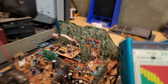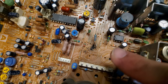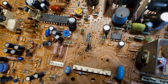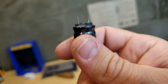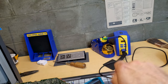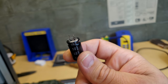Looking at the board where the capacitors were, there's a weird dark powdery substance on both positive ends — I'm assuming that's coming from the capacitor and electrolytic fluid. Looking closely at the capacitor itself, there's a fluid discharge on the positive rail. The other capacitor, which was still technically reading as usable, is also starting to leak right there on that positive node.